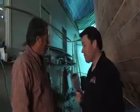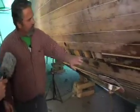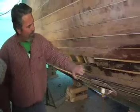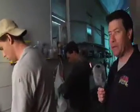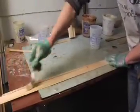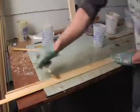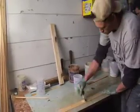Now we're going to go ahead and replace this plank on the boat. Last night Bob went ahead and cut and fit a couple more planks — these are the last two planks on the starboard side — so you can see our sister frames next to our old frames. We're going to come in now, epoxy up all the surfaces, screw our plank in, putty up the seams, and drive our epoxied splines in place, then go on to the next one. Bob is saturating epoxy onto the pine spline so that when we put the plank on they'll be ready to go. It's cool enough — about 45 degrees — so we don't have to worry about the epoxy setting up too fast and we've got plenty of time to work with this.